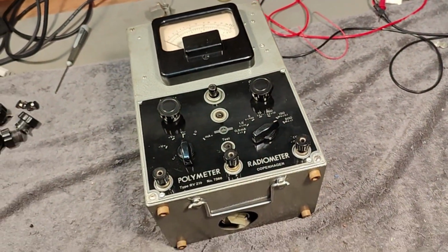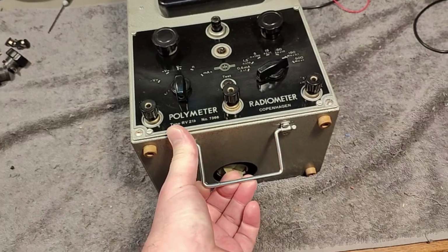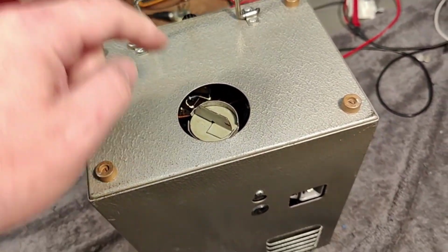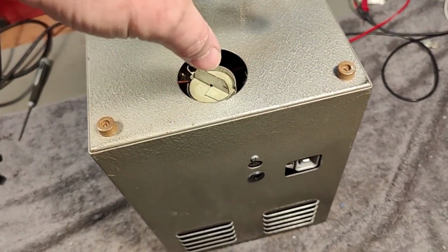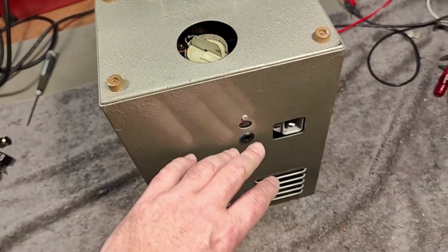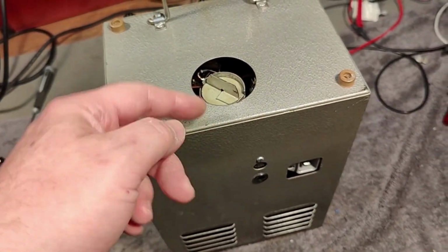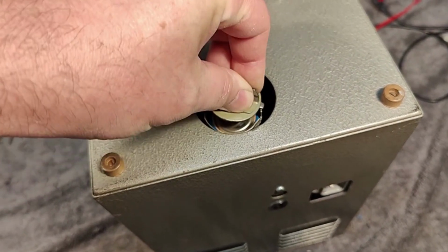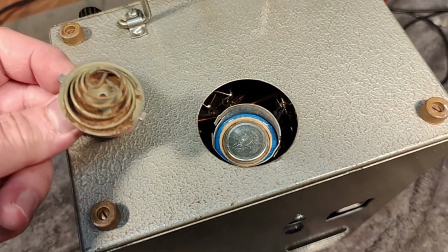The first thing to worry about is the battery. So there's an offset voltage battery, and why? I really hate when they do this, but that is how it was in all these meters back then, and you access the battery here from the bottom, and that is a smart way. In the later models of the different voltmeters, radiometer, they put the battery inside, and it's completely hidden from outside. You can't even see it anywhere. So they had a perfect good solution, and then they dropped it for whatever reason. So you push and then you turn, and then you access the single cell. So I better see if this one is leaked, but so far it looks nice and fine.